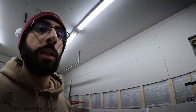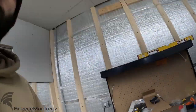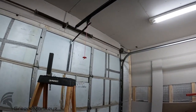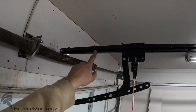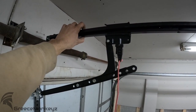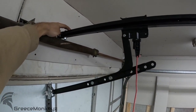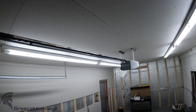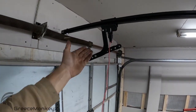So we're not going to do that. I got this model of Chamberlain door opener and I already have it fully installed — well, almost fully installed — just to take measurements and see how much space we have left over. The way it sits, I got like 11 inches before it poses a problem to the pulley. The stopper usually goes here, but there's a tab you can fold up — we're going to ignore that and push the opener back.